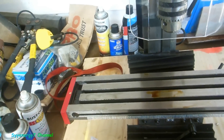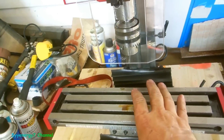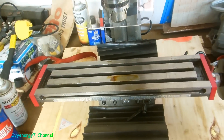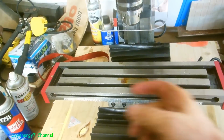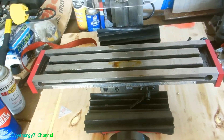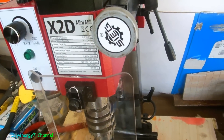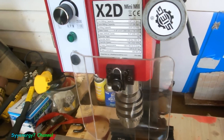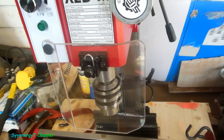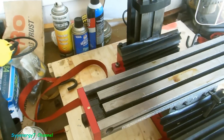What I'm going to get for it — I don't think they sell it at Little Machine Shop — is a tilt vice. Because this is a solid column, that's what I was researching. I wanted something cheap that can work good. It's got a decent XYZ axis for the size of it. The motor is noisier because it's not the high torque brushless motor — it's 350 watts, the high torque is 500. But somebody said they had it 15 years and never changed the brushes. The only thing you can break is the gears, and that's only if you jam it. I might get a couple sets of spare gears to keep on hand.